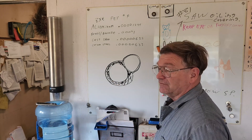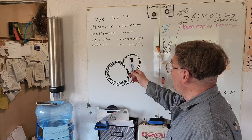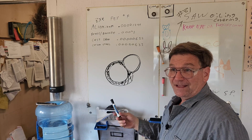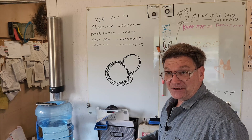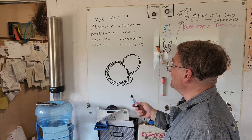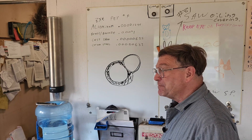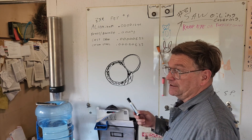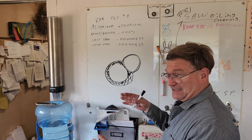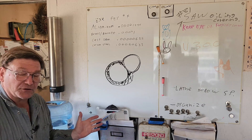The same thing applies with cooling — if the piece is a different shape. But most of the time the piece you're putting in is round, and cooling works a lot of times. Another thing: on your outer pieces, a lot of them I'm working on I can't heat up because I don't want to burn it or disturb it. It might be that you don't want to heat it enough because of how much you'd disturb the heat treating, or there are rubber seals, paint, or sealer on it. The liquid nitrogen did what we needed, and we may have gained a little more clearance had we heated the housing, but it was somewhat out of shape — not definitively oval — so I probably would have gained a little clearance but not as much as you'd think.